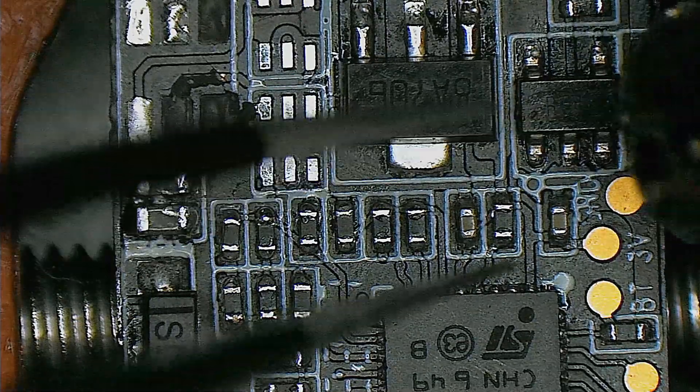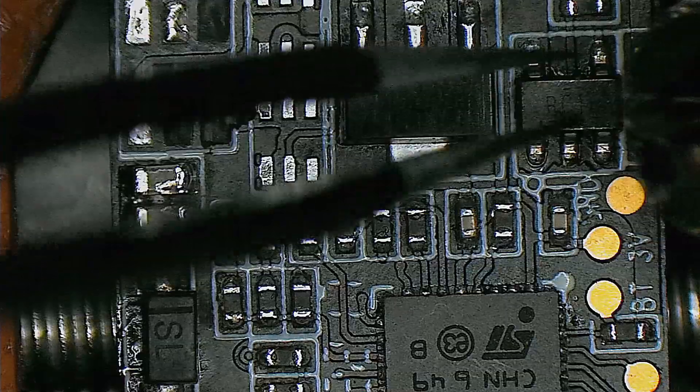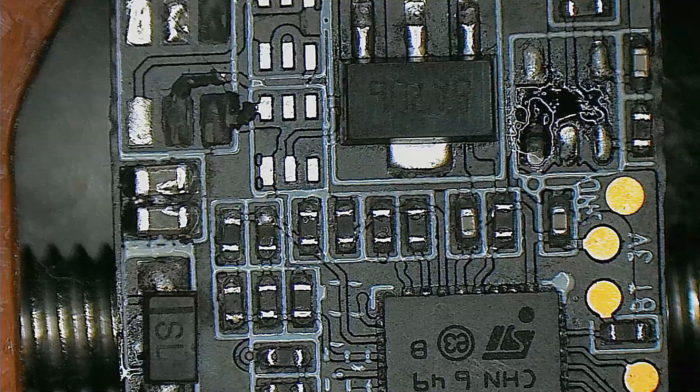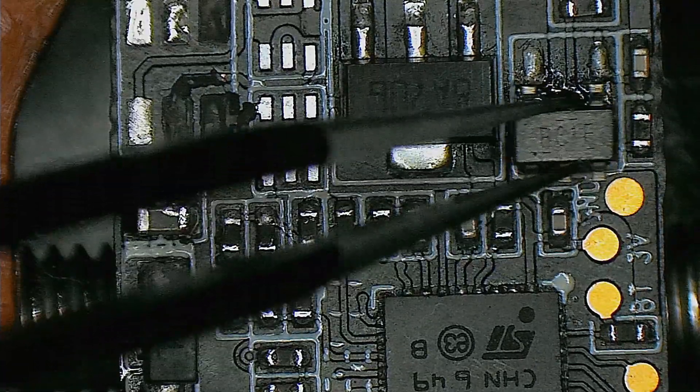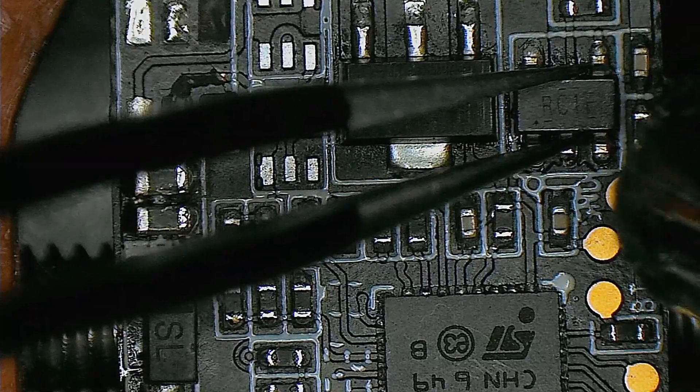So first I am going to take this current sensing IC out. Let's power it up — I can hear the beeps, but same current draw. A good working ESC draws around 30 mA when it's just sitting and not working. Almost 50 mA more is a bad sign. And what I feared the most, I'm afraid it's real. I will just place this IC back because it's not the culprit here.